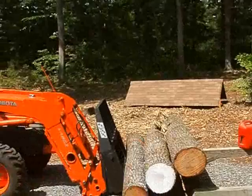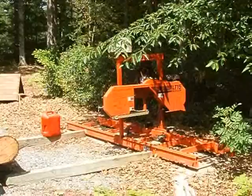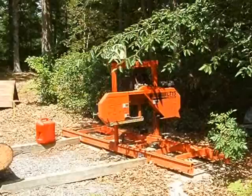There are a few things you need to mill up lumber other than logs and Anchor Seal. The first thing you need is a sawmill. I've got a Wood-Mizer LT-15 — it's a 15 horsepower mill. I can put a 10-foot log on there, up to about 28 inches in diameter, and mill it up. It's a manual process pretty much; the blade moves by the engine, but the rest of it's manual, and she does a nice job.